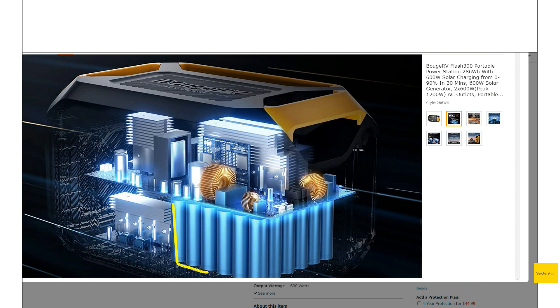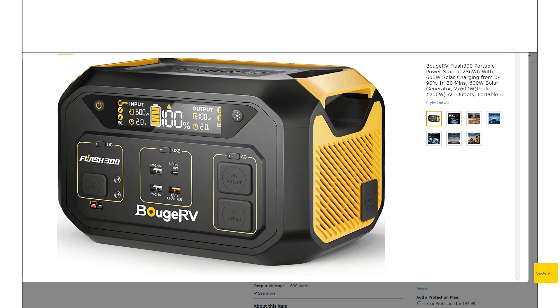They're only using part of the bottom area for batteries. It looks like they have a dedicated heat sink just for the MPPT controller, because as mentioned that controller can do up to 25 amps. Moving on to the design: for USB we get four USB ports. One of them is a 100-watt USB-C, and this is actually bidirectional.